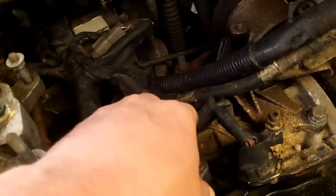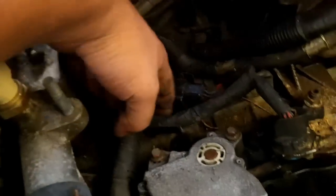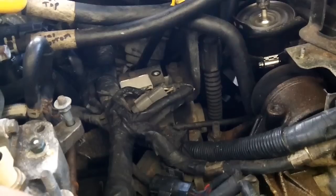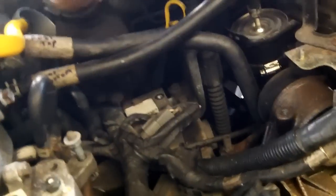Right now we're working on taking off the harness because this harness is laid over like spaghetti — or a spider web, actually — across the entire transmission. We have to remove the harness first; you can't just rip out the transmission without getting the harness out of the way. Pretty much major step one is removing the harness, and once you get the harness out of the way you'll have a much better idea of what to do next.